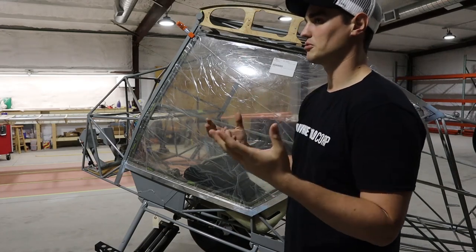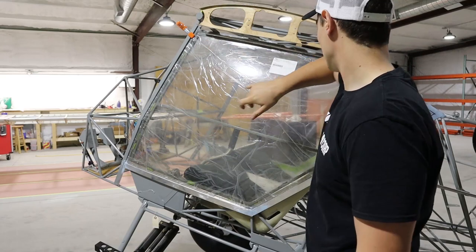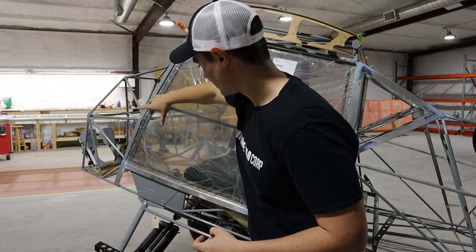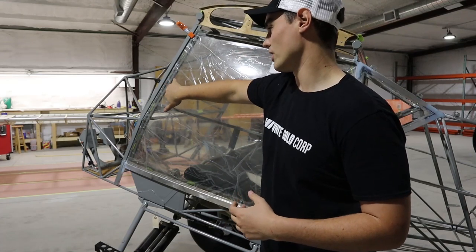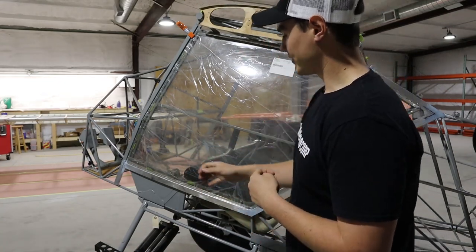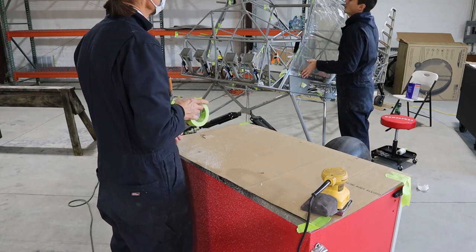To line it up, the black and white sheet they give you gets the general idea. Project Kit Fox has a really good instructional — he just holds it up, marks where the tabs line up, and cuts it short. One thing Harlan Payne from Farm Fox in Southern Illinois did was mark the curvature of the door to help line it up first. You can feel the transition from curve to flat. I hit that curve with a marker all the way around, which makes it obvious when you're centering the door frame.